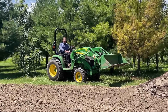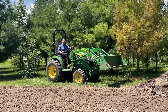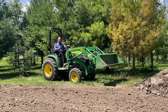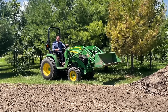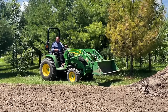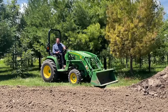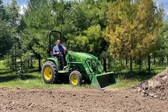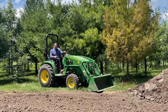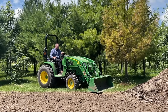Usually what I'll do, make sure I get on a level surface, I'll take my bucket and I'll be perfectly level, and then I'll just go one click up, because I don't want to dig if I'm picking up mulch on grass or something. So I found my baseline, and then one quick tap. Then I'm going to get down until I watch this. Okay, I saw that, but again, I don't want to dig, so I'm just going to do one little quick click. So right there it moved, and then I'm just going to go up one time.